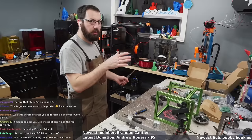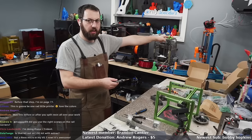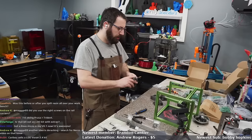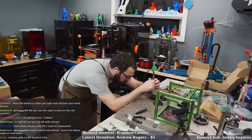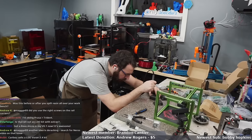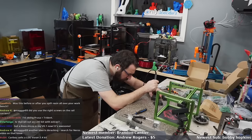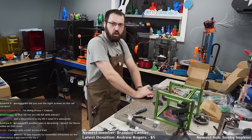I have a Revo 6 in switch wire. I had one jam that I had to do a cold pull. Remember, that has an ERCF carrot feeder, so that's doing thousands of filament changes. And I had one jam that one cold pull fixed. That's the only issue I've had with Revo, one jam that I fixed with a cold pull, and that was filament related. I had no heat creep issues, zero issues with ooze or leaking. It's been like 99.9% reliable, and the only issue is not related to it itself, I believe. Now, granted, the beta units themselves had some issues that were related to them being beta units, but any issues that I would be concerned about were corrected on the production units.